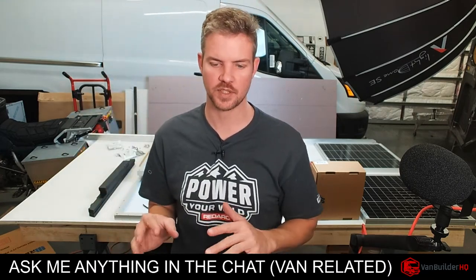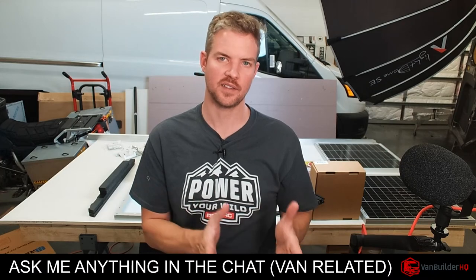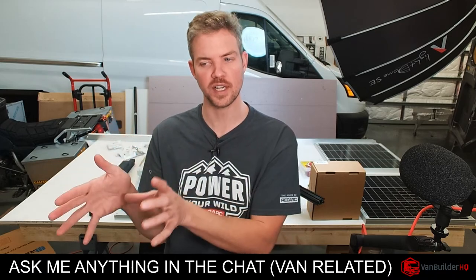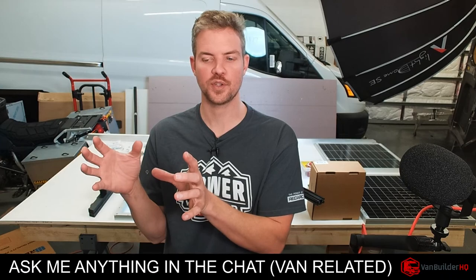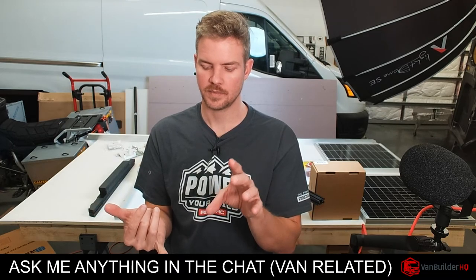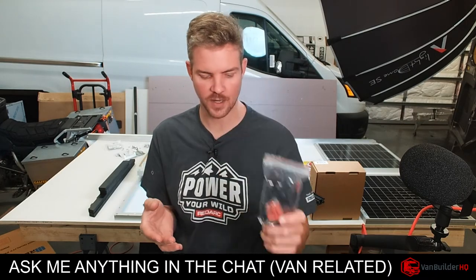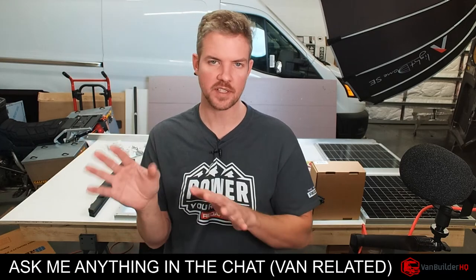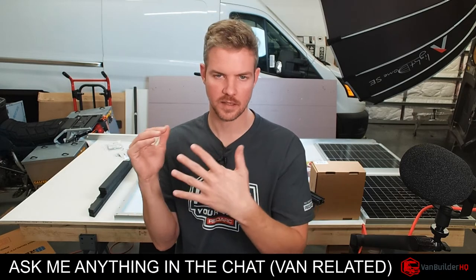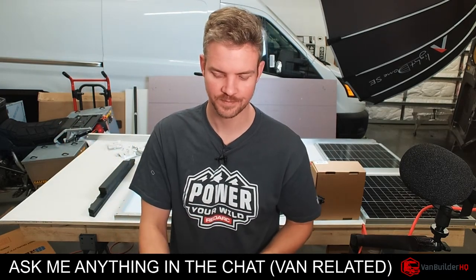The reason we're doing this is we're trying to eliminate everything in the van that is being run off of the inverter. For example, things that Thomas has been running that are not necessary to be charged by an inverter. Anything like a MacBook or cell phone, heated blanket, Wi-Fi router, the Blink camera, all this stuff is so low voltage that it's not necessary to turn on a 3000 watt inverter and then power a 15 volt device.